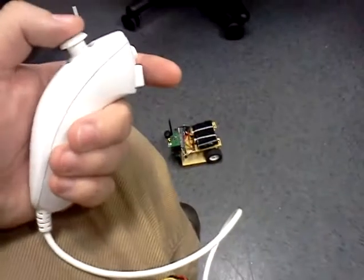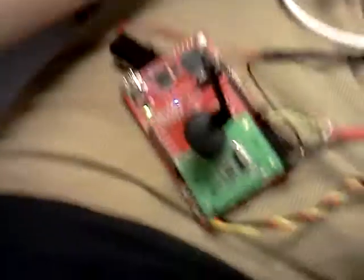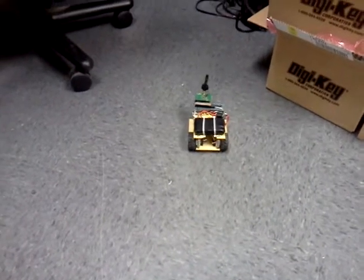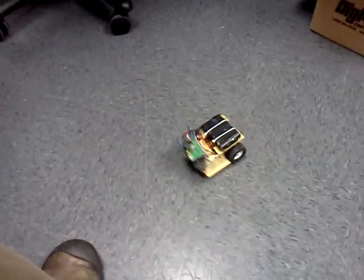It's running in fast mode and running pretty well. I'm running the wireless protocols that my dad wrote — I ported them to the Cortex-M0. On the controller side, I'm running TI's plain old MSP430 to CC2500 radio library. Thankfully, I'm running the same packet format and the same radio settings, so they understand each other and can have bi-directional communications. Right now I think I'm running at 250 kilobits, sending a 30-byte packet about 60 times a second, so I'm not really taxing the radio much at all.